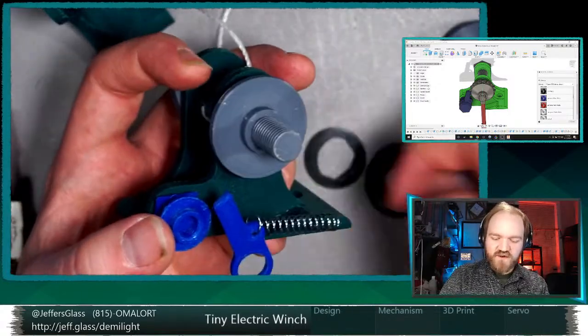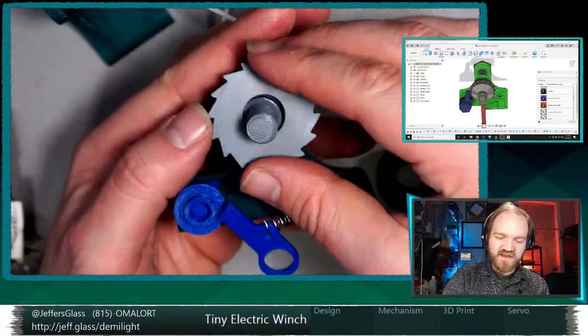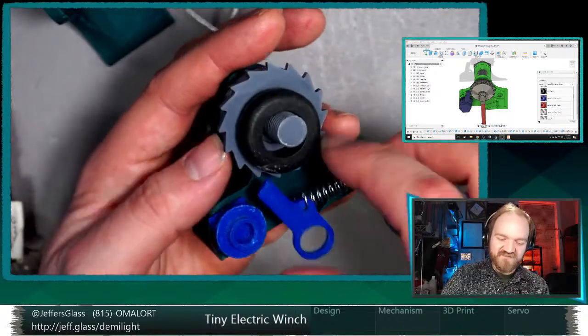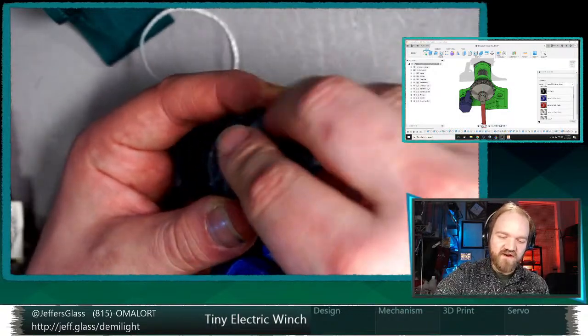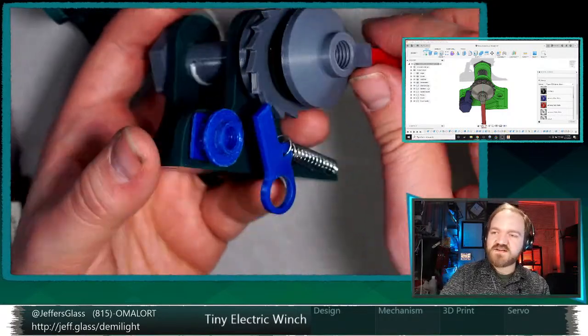So how does that help us? Well, let me do a little bit of reassembly here. I'll put our friction washer back in. I'll put our free-floating ratchet back in. I'll put our fat friction washer back in, and we'll thread our handle on here. All right, so it's just making a nice... So you can see once we've...